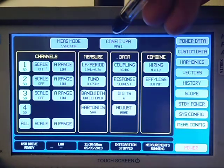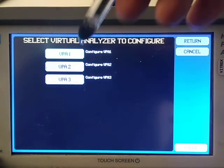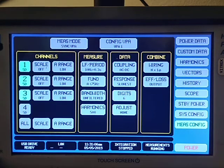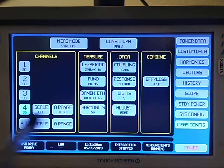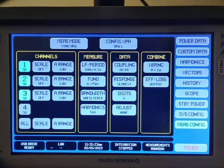Now, over here under config VPA, I config VPA 1 as an example. And in VPA 1, I've got my channels 1 through 3. Again, that's the output of the variable frequency drive. And in VPA 2, I've got just channel 4, and that's my input to the variable frequency drive. So what I like to do is come in here and set up each of the different channels.